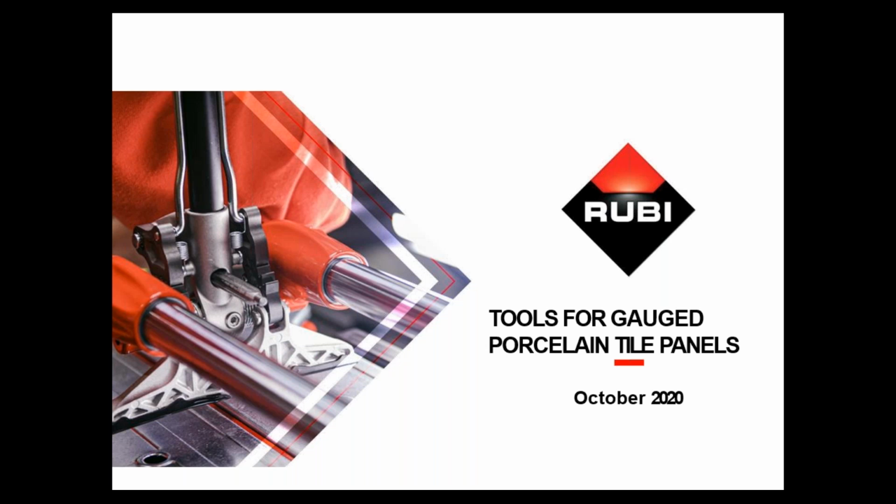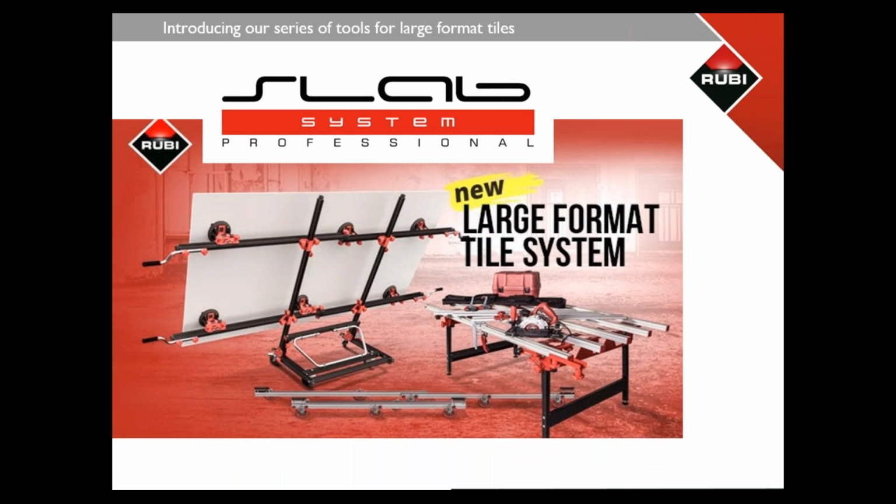All right, so let's get started. Slab. What is slab, right? A slab, the definition of slab is anything with a side that's 48 inches or bigger on a piece of tile. What we have when we've launched is tools to help manipulate, to help cut down, to help install these large format slab tiles. The slab tiles, like I said, are 48 inches and up to 5 feet by 10 feet, and as thin as 3 millimeters.